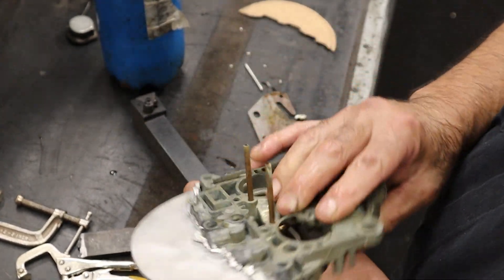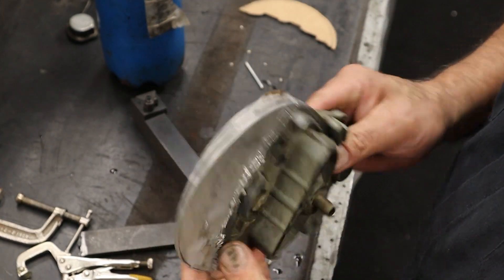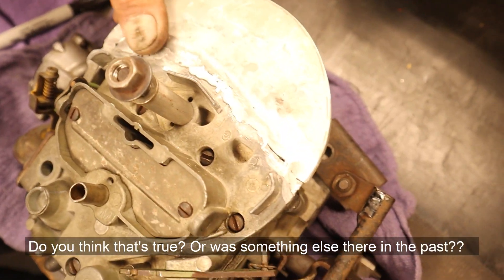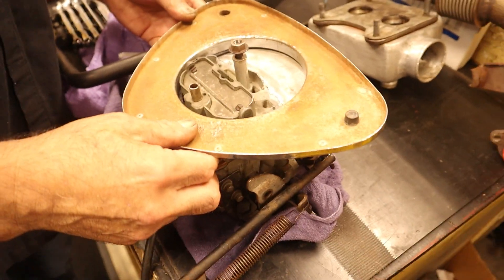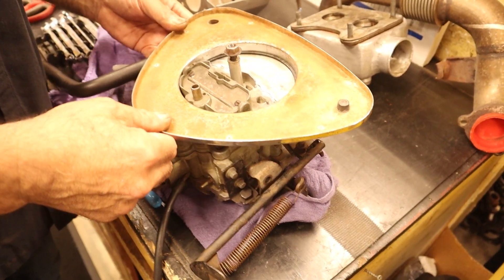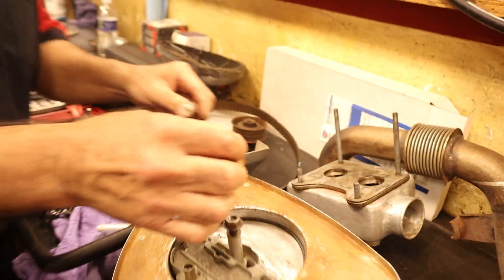It's not the prettiest but you're welding dissimilar metals — it's kind of like soldering. I'm going to dress this top up so we don't lose any pieces in the motor, and just dress the bottom a little bit. Look at that — that came out awesome! It's just there to keep dirt from going in. It was a two-barrel and you wanted this four-barrel air cleaner on it. So there's our gasket going on top right there perfectly, and this goes right there. It can't move that way, that way, or that way — but it can move this way. So we need to put a little tab there to hold it in place.